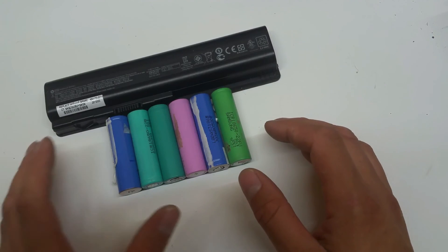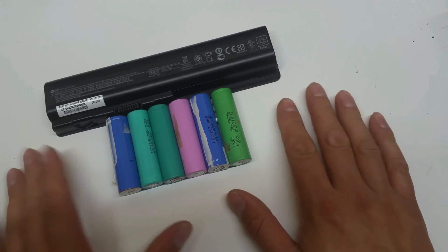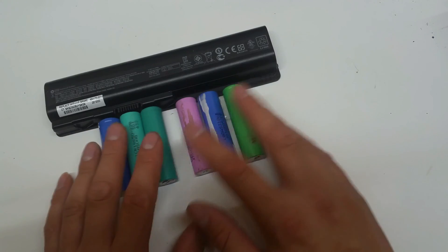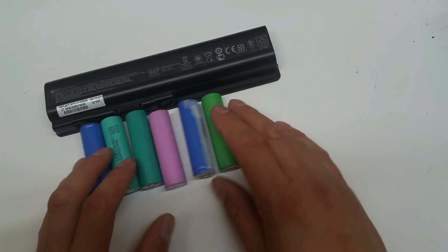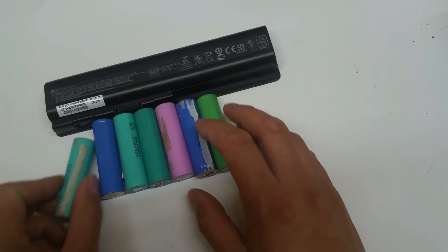The Arduino idea tickles me but I have no experience with them so I won't be undertaking that. It's going to be a 12-volt pack for now, and then if we get enough cells we're going to make it a 24-volt pack with 7 cells in series.